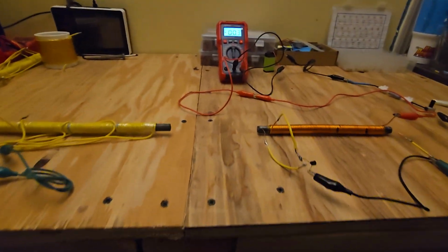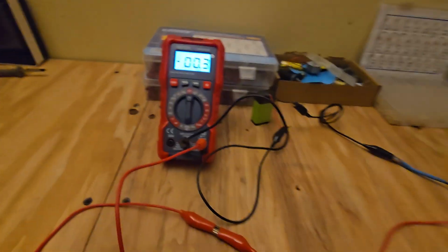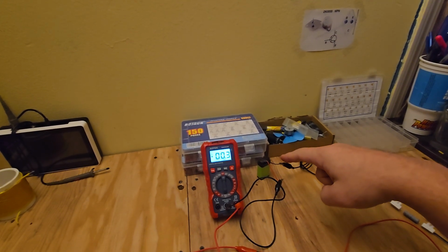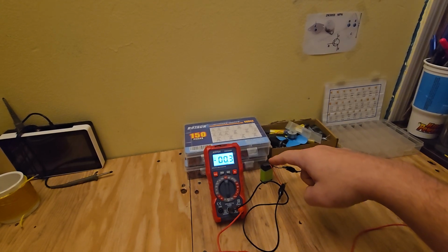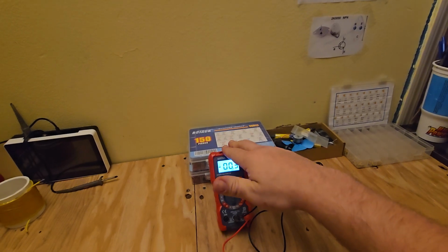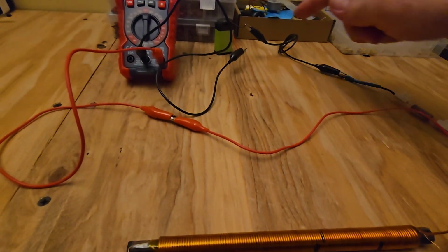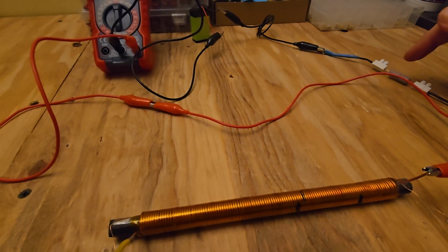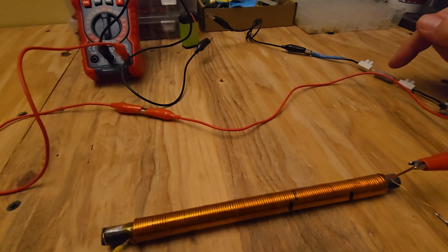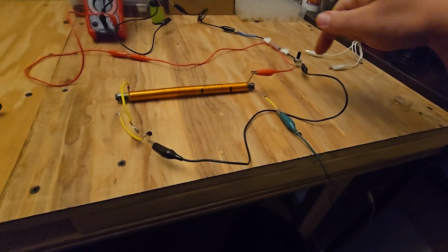And this has gotten very exciting. So yeah, again, to sum it up, we have a 9-volt battery powering the device. We're measuring the current flowing through the circuit. The 9-volt battery is connected in series with a meter in current mode, so we can read the current going into the circuit. We limited the current being fed into the circuit with a resistor, a 5-watt resistor, and a potentiometer. We can fine-tune it with the potentiometer.